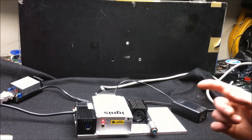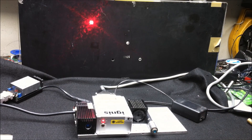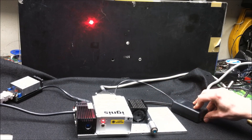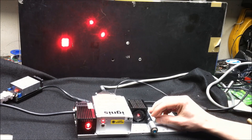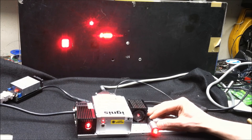I'm going to remove a beam block — there's a mirror on the other side of the room and we can see the output beams here on this black piece of glass. In some cases a direct diode laser can reasonably hold its own against a DPSS laser, such as the one used for DVD burning. You can see it has a reasonably good beam profile. But the 500 milliwatt, 655 nanometer laser has a very big beam profile in comparison, and the 638 nanometer Oclaro is also really big compared to those two.